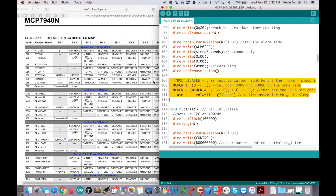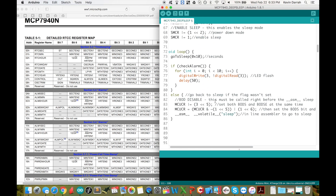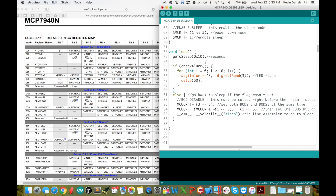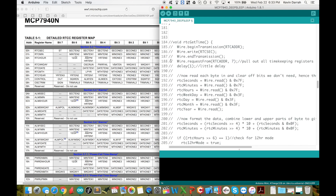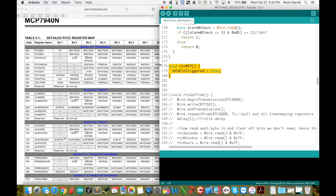At this point the Arduino is in a complete deep sleep state — it can only be woken up from that external interrupt. Then we wake up — specifically inside the interrupt handler, void rtcMFP — and the only thing I'm doing there is setting a flag. I set the MFP pin triggered flag to true, so I get in and out of the interrupt quickly.